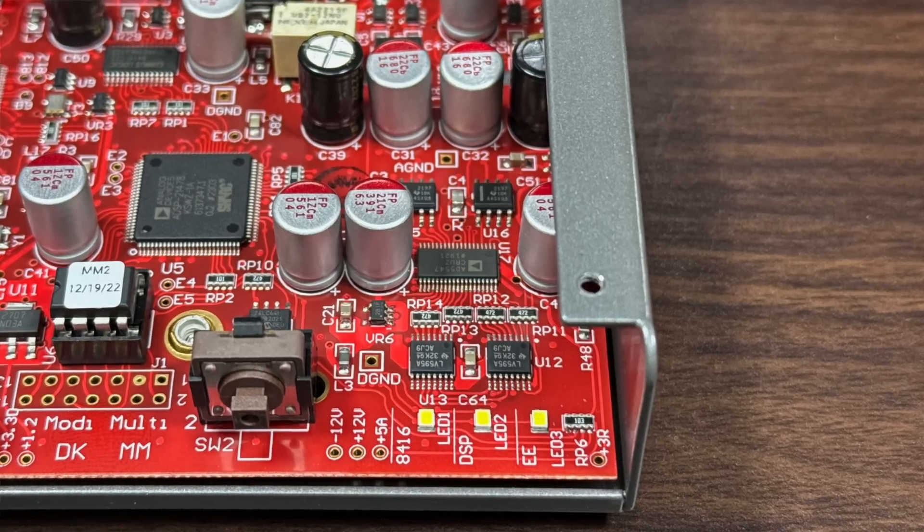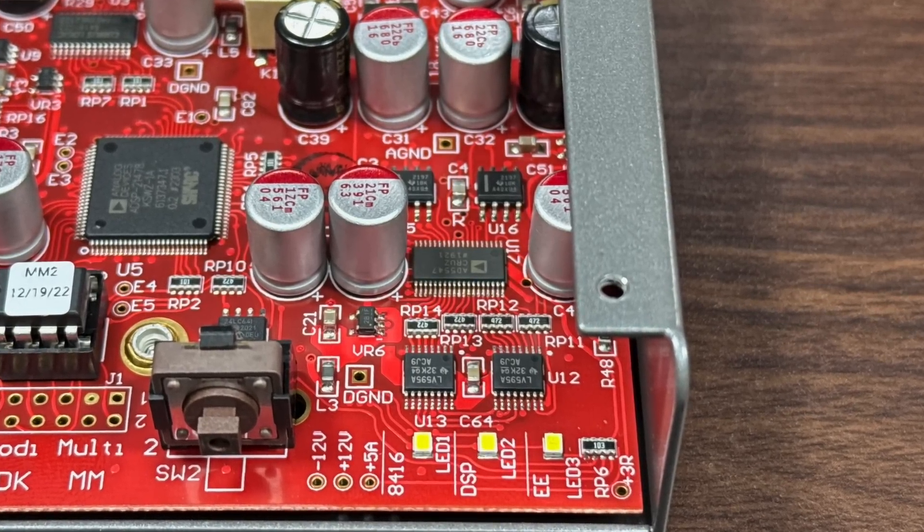Building your own resistor ladder board, which is popular in devices such as the Audio GD and even the HiFiMan Golden Wave Serenade behind me, is not going to fit into such a small box. There are also issues of accuracy with individual resistors, as there are no resistors accurate enough to do proper 16-bit audio. So industrial chips it is — these chips are used for controlling motors, whereas a regular Sigma Delta DAC is no good because, to very grossly oversimplify things, the output is kind of averaged. An R2R DAC outputs exactly what is put into it in terms of the voltage required, making it perfect for motors. That was a challenge for Schiit to overcome, and they managed to do so, much to the surprise of the manufacturers of the chips.